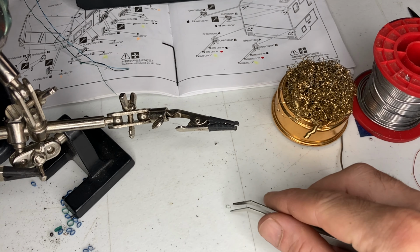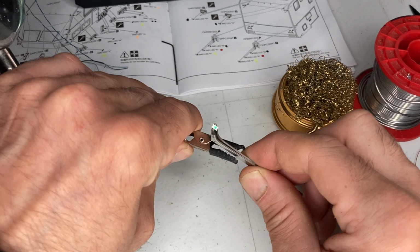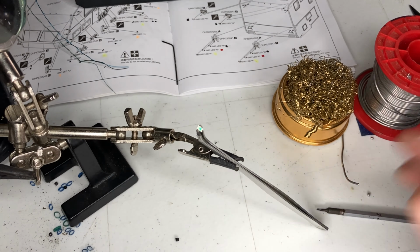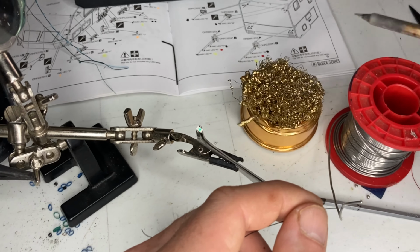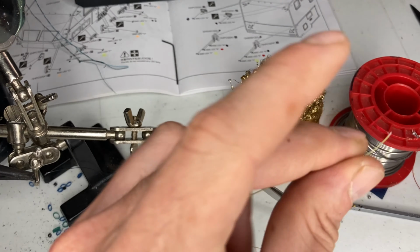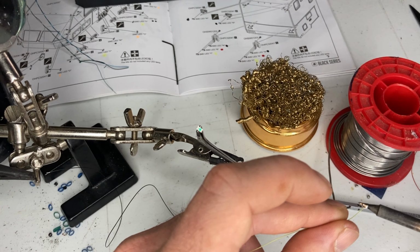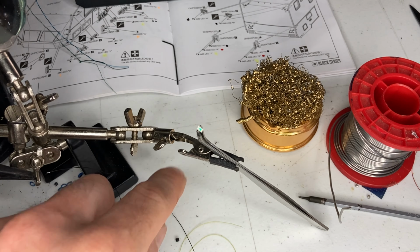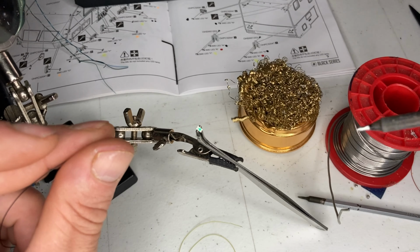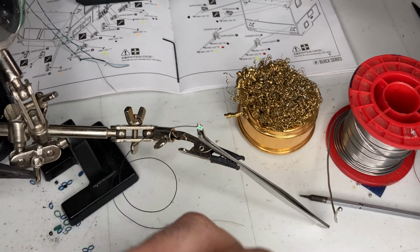Right, these tiny LEDs. Yeah, believe it or not, there was one there. Right, so pick up an LED, put it in the tweezers, put the tweezers in a crocodile clip, and then get your wire, tin it, so clean your iron, mate. The other one, I'm using yellow LED, so I've gone for yellow cable. Both ends have been tinned nicely, that's it. Right, so you ain't even going to be able to see this, but here goes nothing. One done.